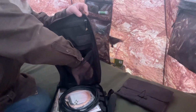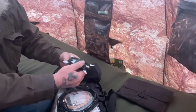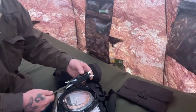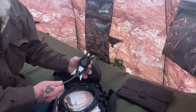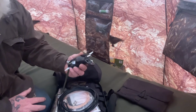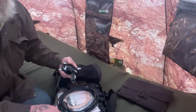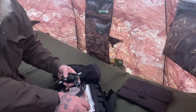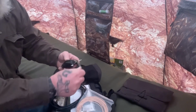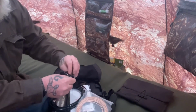And then I've got my MCOM3 antenna. This antenna is an end-fed half wave for 20 meters. That's the entire antenna. Basically, all you gotta do is hoist this thing up into a tree on a sloper. Plug your BNC connector into that bad boy if you're using this thin stuff right here. And that is your antenna system. So it's really portable, really small, and easy to use.